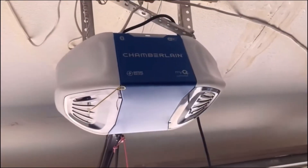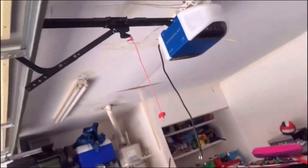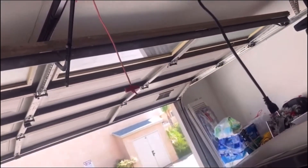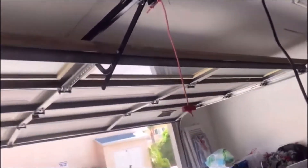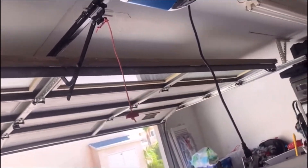It's using the battery for the safety eyes as well. The safety eyes are working down here — you can see a green indicator light that indicates your safety eyes are working in case there's an obstruction while using the battery backup. If you lose electricity or have a circuit breaker that failed in your house, or if you come home and you're experiencing a power outage, your opener will still work instead of having to pull the red release rope to open the door manually.